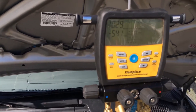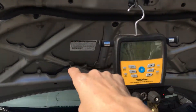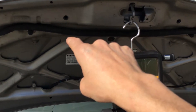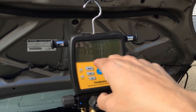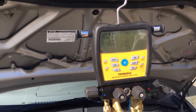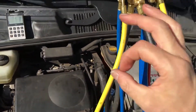There was a little jump, but other than that it's just coming to a dead-head right here. If you watch this on a graph, you would have seen a drop really fast right into microns, and then as it was approaching about 1500 it started leveling out and slowing down. It was still going down, and as it approached 1100 and below it's going slower. So this is its level-out point. Now — is it because of a leak, or is it because of moisture?